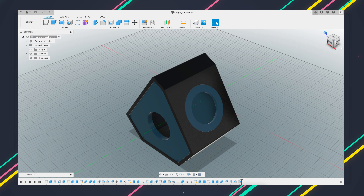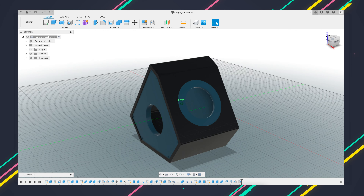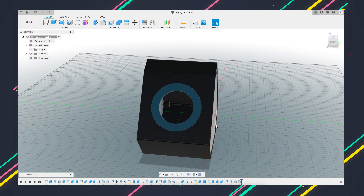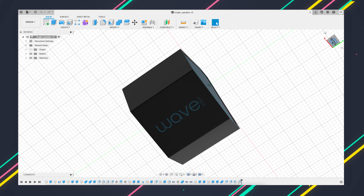This is the design that I came up with. I used Fusion 360 for this and it's pretty basic. I just have this outer shell, a panel for either side, and then a fitment ring to kind of adapt the speaker size. I originally designed this enclosure to use the stereo speaker kit, but since they didn't have that in stock, I decided to just cut it in half down the middle, make a single speaker, and adapt the hole so it would fit the smaller speaker. I named the speaker the Wave Mini since it's the smaller version of the original speaker I was going to make.